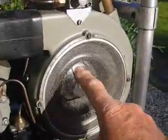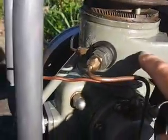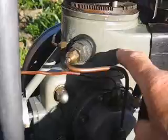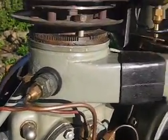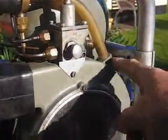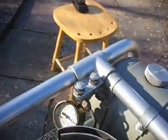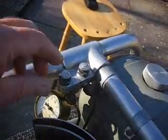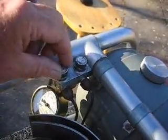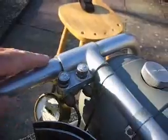This, of course, is the cooling fan. This one blows the air around here and keeps the cold end of the engine as cool as possible. Also, there is some air bled off from here up to this pipe, which is the air for the atomiser. You open this valve and the peak pressure from the engine is transferred into the reservoir.